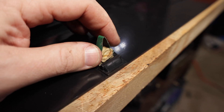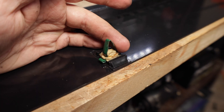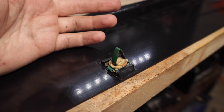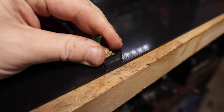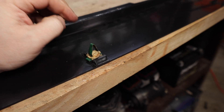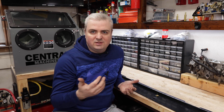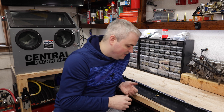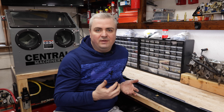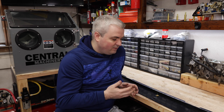You do have some XY movement here to locate where that is correctly, but it's hard to get everything perfect. The problem I've had is these do pull out, and when they do pull out they fall and they're hard to get to. So what I'm going to do is take some measurements of this, build this up in SolidWorks. From that, we're going to be able to build a small flat plate. Now I'm looking at what the best way to adhere this plate is — I think probably roughing up the surface and then using some foam tape on it just to get some adhesion to it.